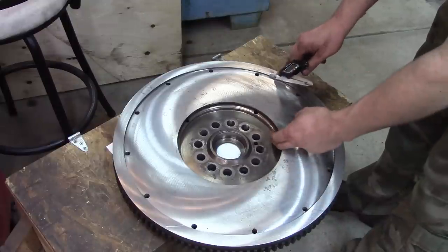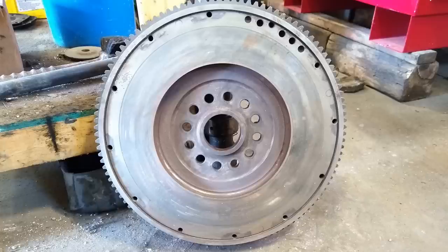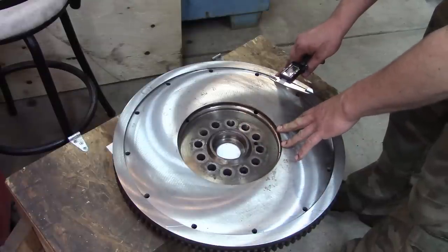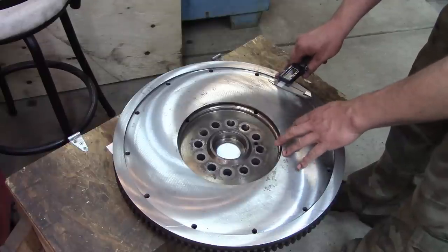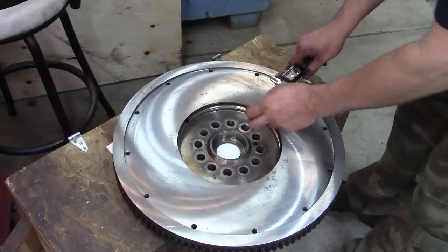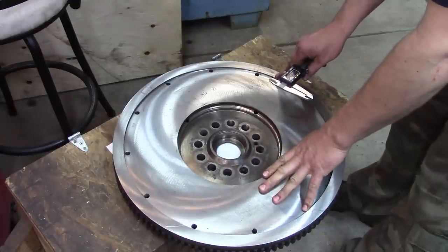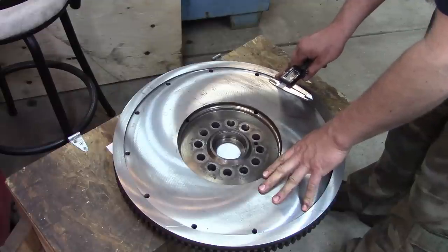The depth we have to go down — I took a measurement off of a flywheel we have on the floor. Yes, the flywheel is off of a Cummins, but it's made to fit the same clutches. We're going to have to go down about 730 thousandths, or a little over 18 millimeters from the surface. And what I want to do is put a small radius in the bottom — that'll help to avoid any sort of stress risers from a sharp square corner from an end mill. Before we can do this, we have to get the mill set up and figure out how we're going to hold this and keep it accurate as we cut it.